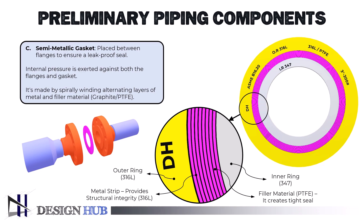Gaskets that combine two or more metallic and non-metallic elements are referred to as semi-metallic. The non-metallic part of a gasket can seal the integrated component, while the metal offers the gasket strength and durability. Although ring-type joint gaskets are often employed at ASME class 1500 and higher, these composite gaskets are used in low-pressure (ASME 150) through high-pressure (ASME 2500) classes. Spiral-wrapped, metal-jacketed, cam profile, and metal-reinforced graphite gaskets are examples of semi-metallic gaskets.